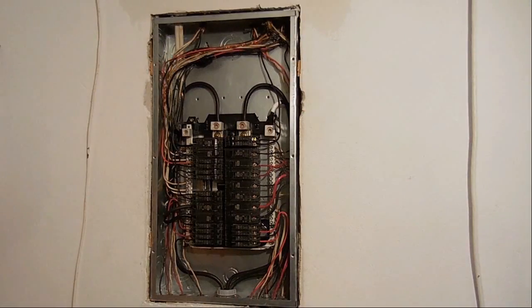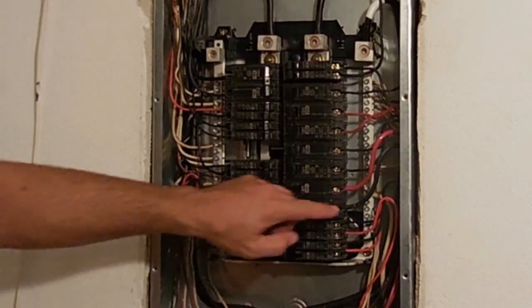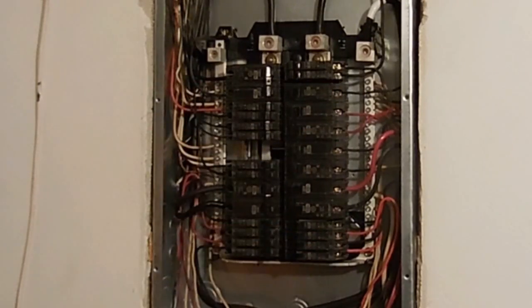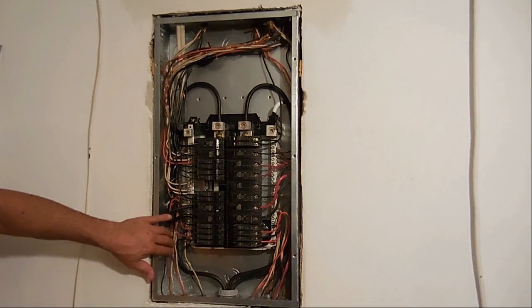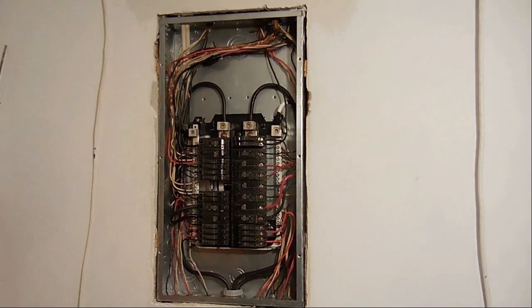The panel is now completely installed. All the breakers are in position — you can see all the hot wires, which are black and red, connected into each circuit breaker, and all the white wires and bare copper ground wires are secured to the terminal strips on the left and right side. Ordinarily I would have all the neutrals on one side and all the grounds on the other to keep things neat, but because the wires in the old panel were much shorter I was unable to do so, so I have the neutrals and grounds all on the neutral bar, which is bonded. I hope you enjoyed this video — if you did, please give a thumbs up, subscribe, and post links to this video on other websites and blogs. Also be sure to check out my video playlist. Thank you for watching.